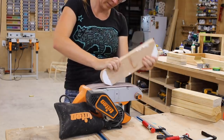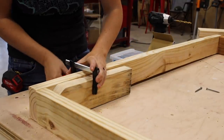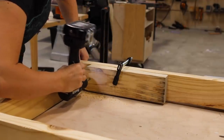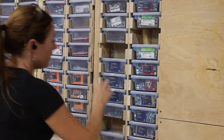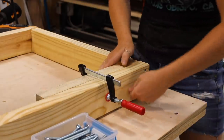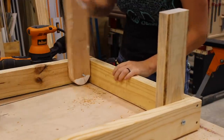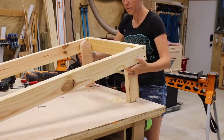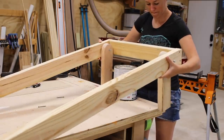After repeating to make a matching second leg, I clamped the first one into place right on the inside of the body. Then I used a bit to drill through the leg and the body at the same time. This will be the hole that a carriage bolt goes through to make the legs actually rotate. I went through my hardware collection and pulled 3.5 inch carriage bolts — feed these in from the outside of the body and through the legs, and you'll be able to start seeing it working.